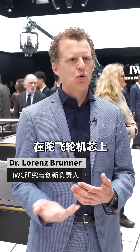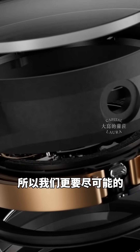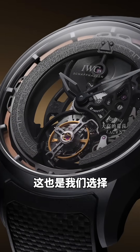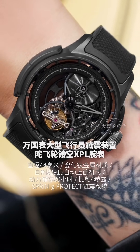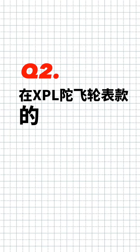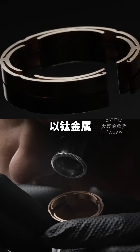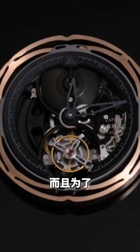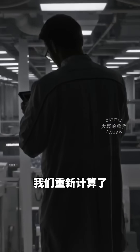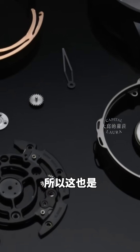For the first time we have used the tourbillon movement in the shock absorber system. The tourbillon movement is bigger than the one we used in the previous shock absorber system, so we tried to make it as light as possible — that's why we made a skeletonized movement. We use light components like titanium rings, and also for the BMG spring, which has very high elasticity. For this specific watch we had to recalculate all the springs because the movement is also bigger than the previous one, and that was quite a challenge.